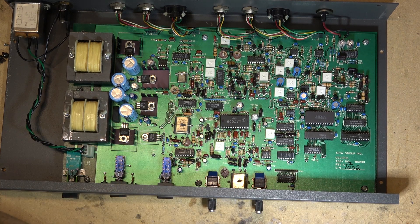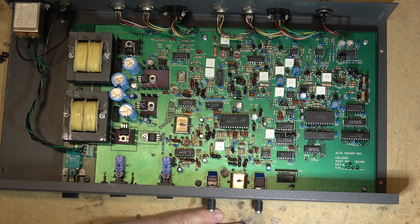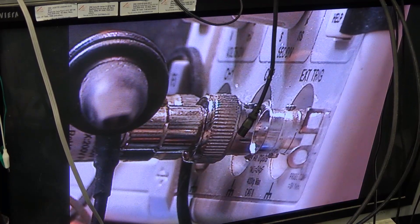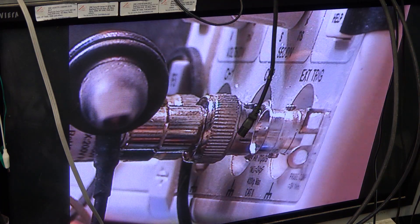I'm trying to think if I've got something I could actually plug this thing into and just see if it works. Maybe I'll try it out — find an S-video signal, like from a Hi8 camera, plug it in, and play around with the luminance delay to see if it shows up on the monitor. So here's a signal passing through it — I know it's passing through because I can switch from YC688 to YC358. If you had a recording done on a machine that used 688 kHz, like a three-quarter inch machine, that's what this would be used for. 688 kHz was used by three-quarter inch and Betamax — that was the color under heterodyne frequency.